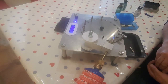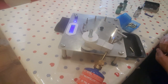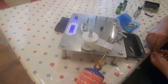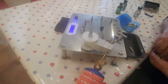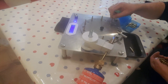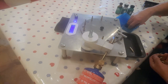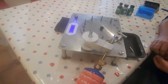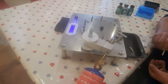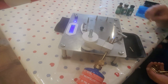I've made a few of these annealers for friends. They're quite easy to make — relatively few components, and I have most of the parts either laser cut or waterjet cut. The hardest bit was getting the code made for the timer itself, to give those quarter-second increments accurate to within two milliseconds. We're almost done — nearly a hundred cases done in about 10 minutes, which is very easy, very consistent, and very reliable.